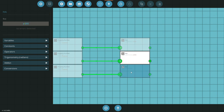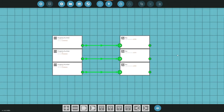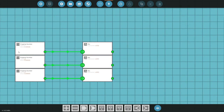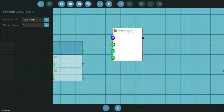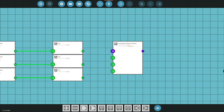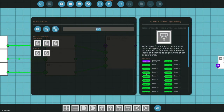We'll copy and paste that across for all three channels. Now we can physically change the values in our microcontroller to change the colors for the light. If the value is 255 it gives us a 1 signal; if it's 0 it gives us 0 — exactly what we need. Now we add a composite write number node, and for this we need three channels — channel 1, 2, and 3 — for red, green, and blue. We connect all three outputs in.